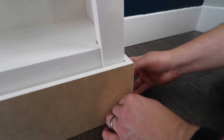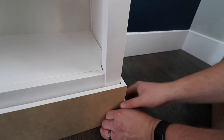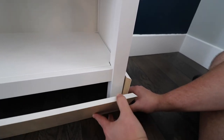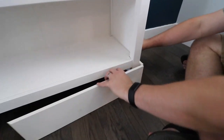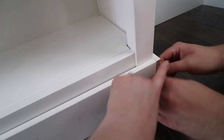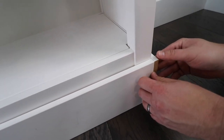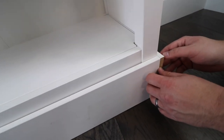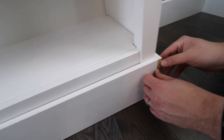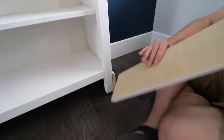What we decided here is we are not going to do miter joints because we end up with gaps. When we did our kitchen we ended up doing butt joints instead. We're going to have the front board be the overlapping board just for looks from the front. We're going to end up doing butt joints just because we think we'll do a better job at it and it'll look nicer with less caulking. So we're going to cut the board that goes all the way down and then re-cut our side boards and nail them in.